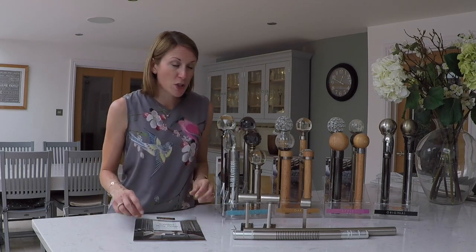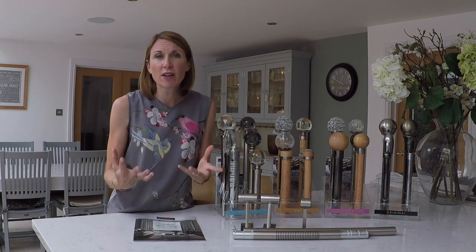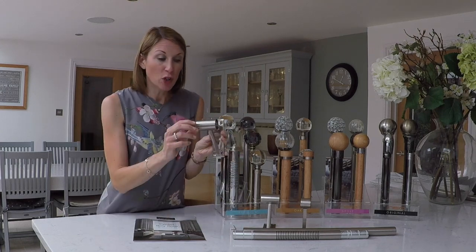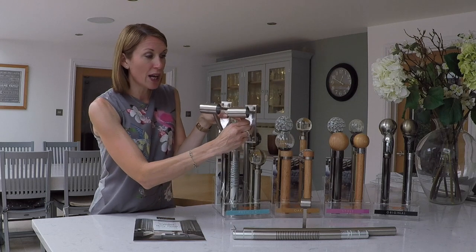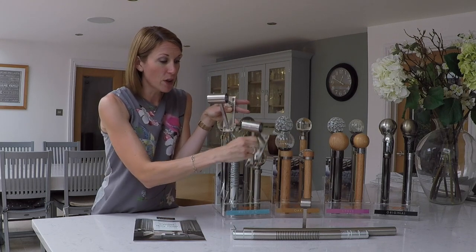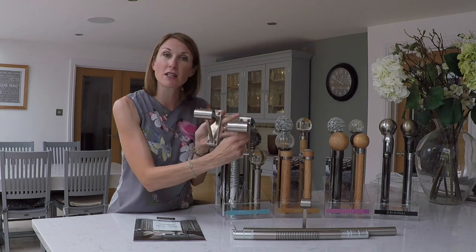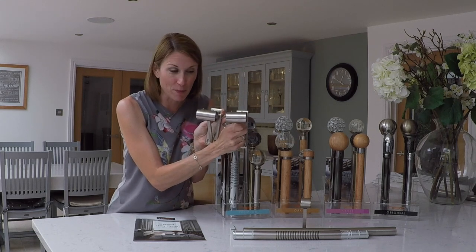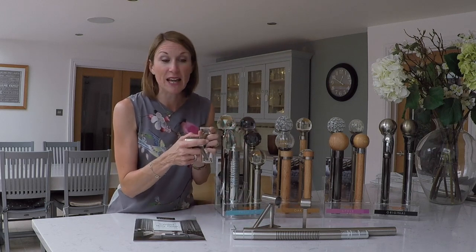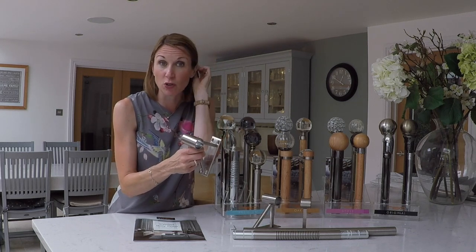On the website we have also set the product up for lightweight curtains — curtains up to 8kg for the pair. Typically these are very light fabrics, not lined, not interlined. On the lightweight option you get one end bracket, while for all other weights you get two end brackets. These brackets are solid die cast with fantastic weight capacity — tested for curtains up to 30kg per pair on a 135-degree bend, giving superior weight capability compared to any bay window curtain poles historically on the market.